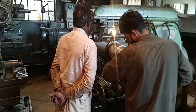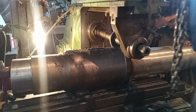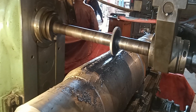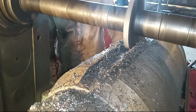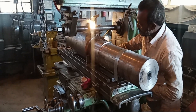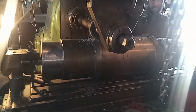Now they move the shaft to the milling machine to cut a slot in the middle — there are two slots to machine in the middle. The cutter is cutting the metal and the operator is moving the bed. Coolant is dripping onto the cutter because when cutting metal on the milling machine the cutter becomes very hot.